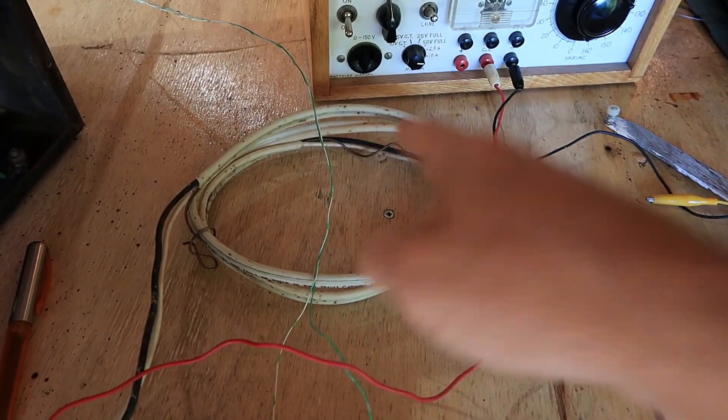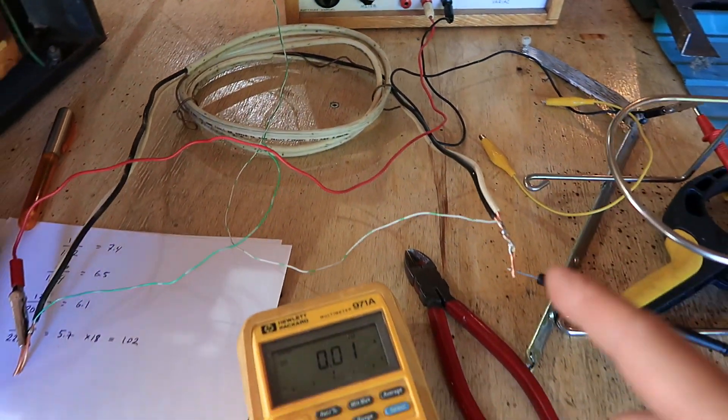Then I realized average current is actually less than RMS current, so I really need to measure the DC current itself to get an actual reading. I need to measure that with a shunt resistor, and that shunt resistor should ideally be about five milli-ohms.